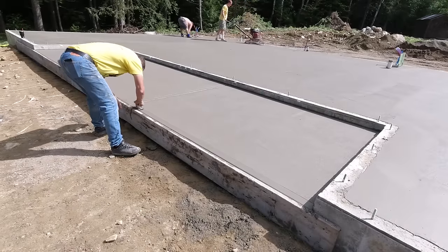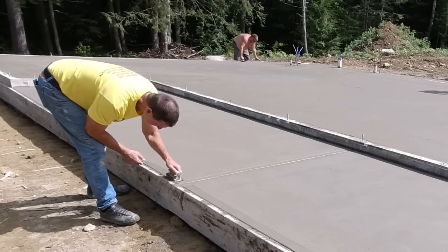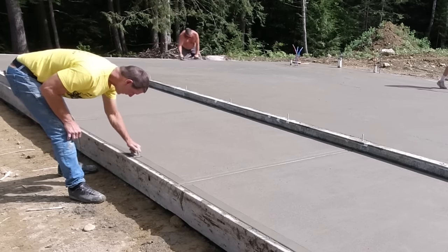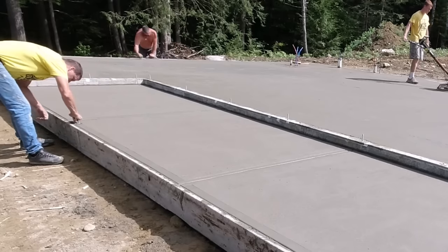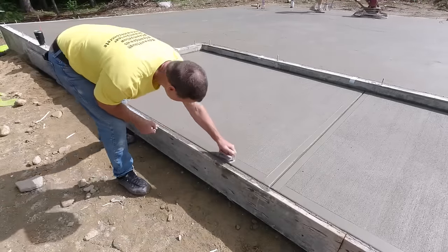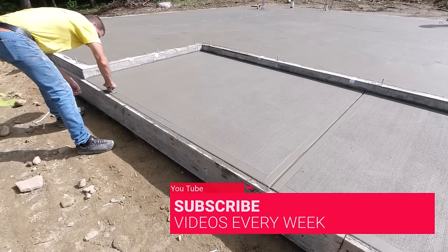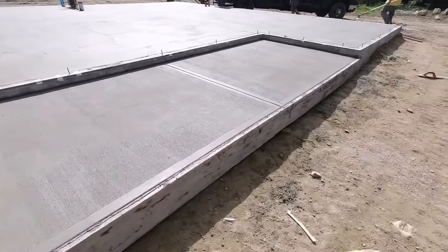That's what it looks like right there for a nice clean broom finish picture frame look. You can see Darren cleaning off a couple of those concrete balls and cleaning that little part up. Luke in the back is continuing to power trowel - he's just learning. The other two guys are mag floating and steel troweling edges. Putting that finished tool on the edger to give it the picture frame look is really easy if you did the pre-edging work nice and flat and level, cleaned up all the rock holes and imperfections. That makes the finish part easy - just enough down pressure to make that edge look nice and smooth. That's going to do it for this one guys - if you haven't subscribed, go hit subscribe, hit like, share the video, and check me out on Instagram and TikTok at Everything About Concrete.